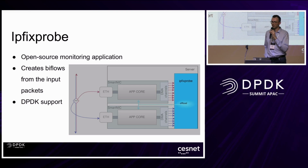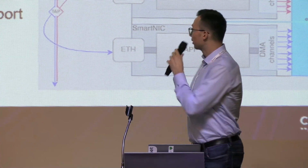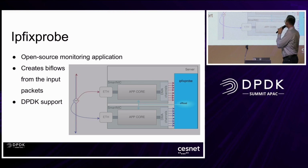I think it worked as it is because, before the 400G card, we used it on our other cards that had lower throughput, but the API was still the same. The app core, what kind of processor is this? Is it RISC-V? Well, that's the processing that we do in the FPGA chip, and it varies. It depends on the firmware that we load. But usually in this scenario, we filter out some traffic using basically IP addresses or ports, and then we export some extra metadata such as timestamp or marks that help the processing in the software.